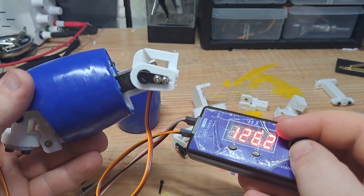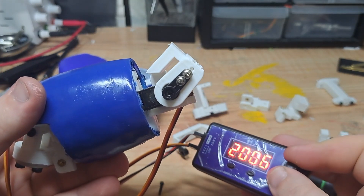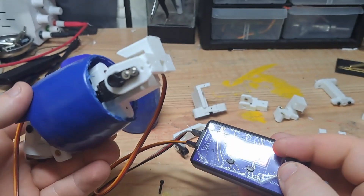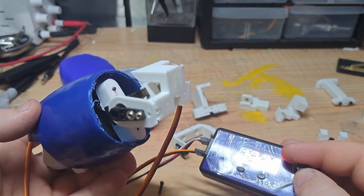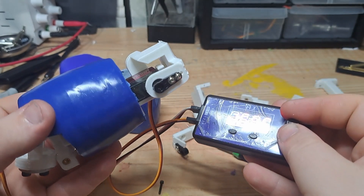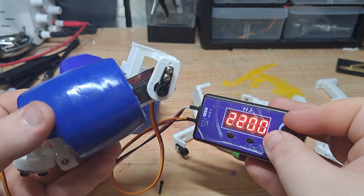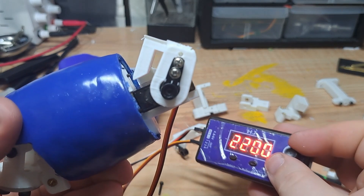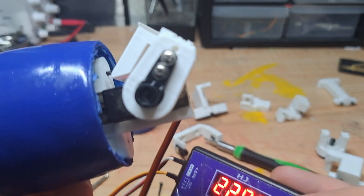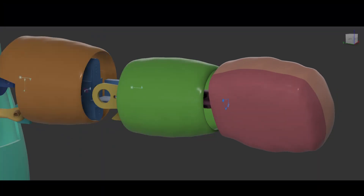Just showing off the PWM so you can see — the closest it can bring the arm to the torso is at 2200, and the lowest is around 15 or 14. I said that because I wanted to be realistic: even though it's an animatronic with a child's soul, the elbow shouldn't bend backwards. Also, it would make it harder for the actual servo to make the full loop.